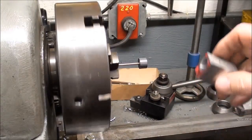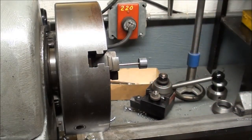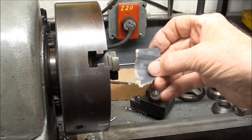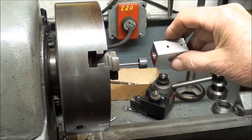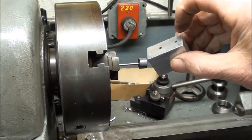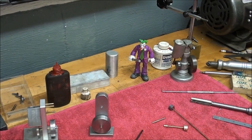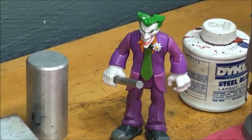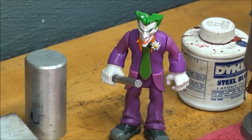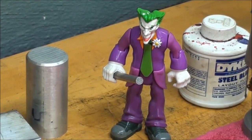I spent a fair amount of time running the piston in the cylinder with oil on it until I got just the fit I wanted. If it was still a little tight I put a little abrasive paper on it just momentarily. The fit should be good enough that when you pull the piston out of there — covering the holes — it sounds like that. If you're to have a good fit, I'm trying to do the best job that I can, because the Joker is watching me with a club in his hand. He hasn't made an appearance lately in my videos, but he is ever present and is a force to be reckoned with.